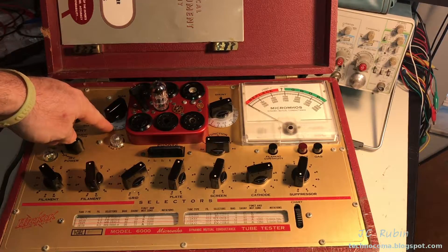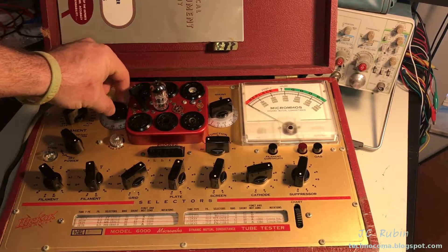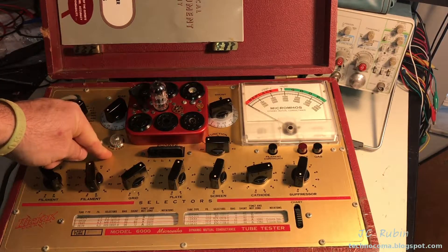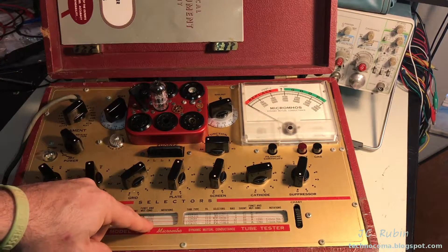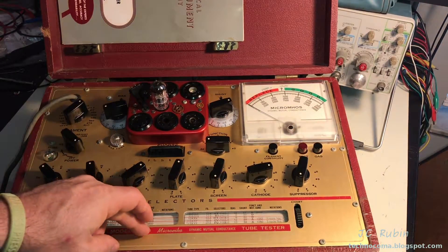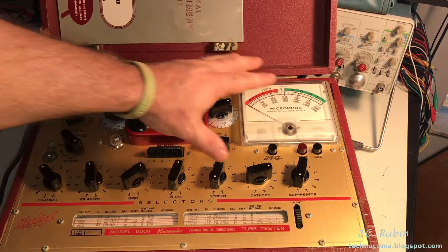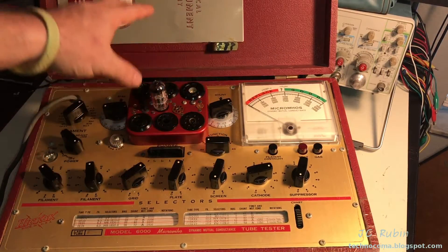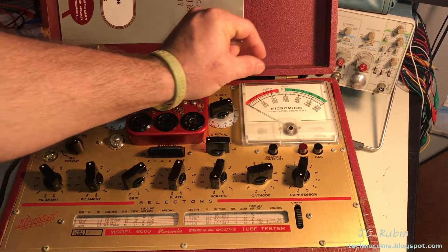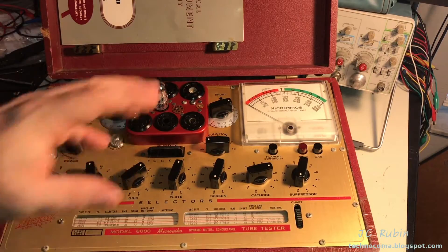That separate switch would have been more accurate, separately calibrated away from the shunt control, and much more repeatable between tubes. But they didn't do that, so if you're off by a little it moves the needle around — it's just not a good design. The other problem is the bias is measured zero to one hundred on the dial, which is fine for pass/fail. But there's no meter to tell you the actual bias voltage. They should have given you a value to set the bias to, with a corresponding voltage reading, so you'd know the actual bias for the tube.